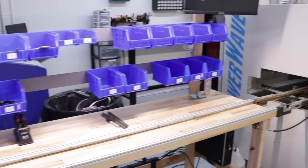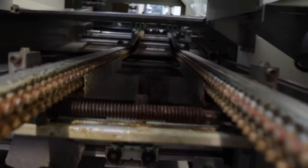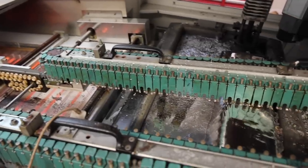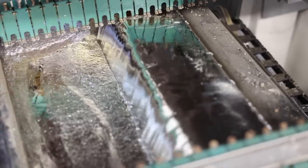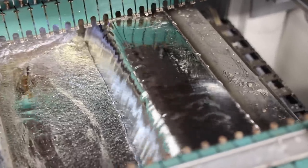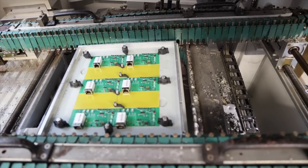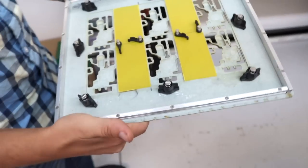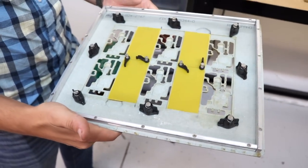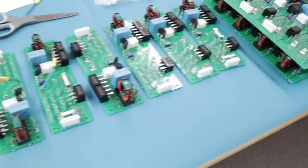There's an entire bench dedicated to populating through-hole parts into boards. Once populated, they go into this huge wave soldering machine. The boards are held over a little waterfall of molten solder which touches the bottom of the board and all the leads, soldering them automatically. There's a really cool carrier tray that holds the boards, covering all the surface-mount components on the bottom you don't want soldered, with apertures where the solder can go through. At the end you get beautifully soldered, almost completely automatically assembled printed circuit board assemblies.